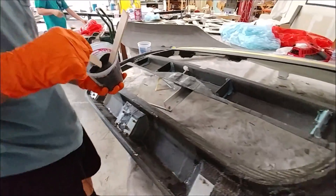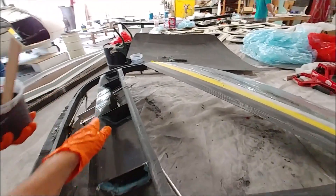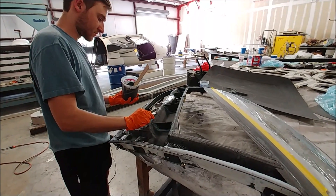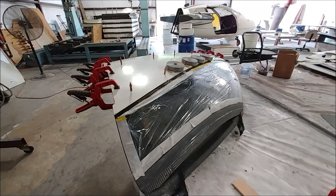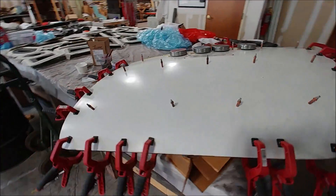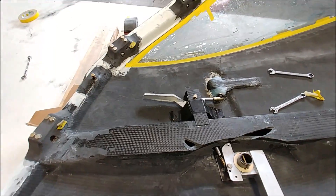Jeremy helped me get the hysol laid out on all the flanges — he was dropping it on where it needed to be and I was spreading it out. Then we clicoed the whole thing into place, put a few clamps on it, and got it all done. At the end of day Friday it had a bunch of cleats in the middle, a few weights on the edge where it meets the glass, and clamps around the outside. We're still going to put the core on the inside and close it out like we did the other one. Keith also made a temporary handle for the inside of the door — you'll see more of that next week.